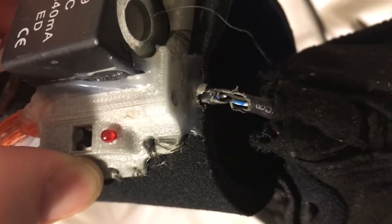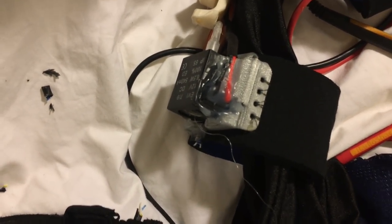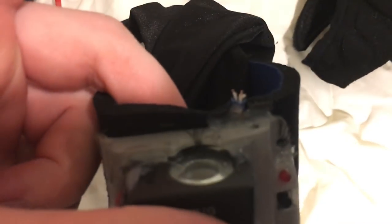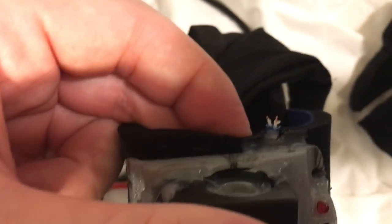It's good I did that so I can see I should figure out a way to fix that. This is a real shame because both of these wires are completely detached. I just need to reattach them. However, this means it will always be weaker there, so I need a plan. I think I may put more heat shrink tubing on, but I think putting puffy paint in there and letting that dry out is the best way to seal it up and make sure it's secure. I've stripped both sets of wires. The good news is it doesn't matter which way I connect them because it's just a resistor - a variable resistor, but still a resistor.